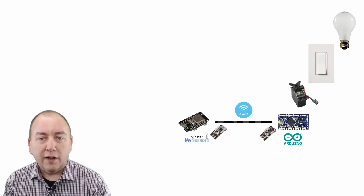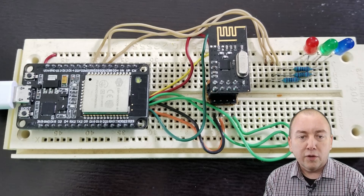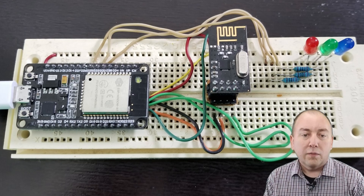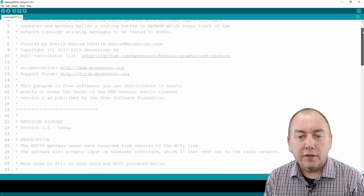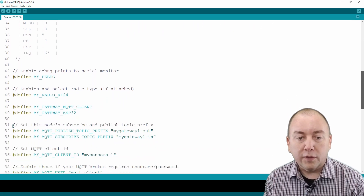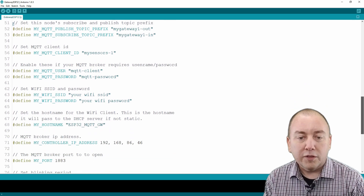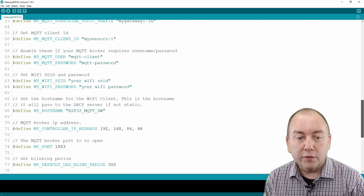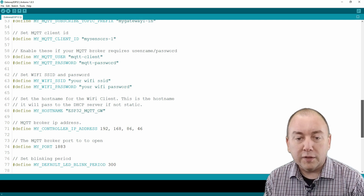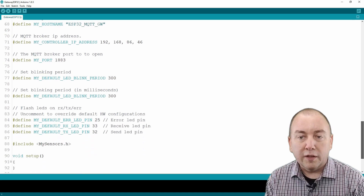Our next device in the chain between our light and the smart speaker is the MySensors gateway. I am using an ESP32 NodeMCU as the MySensors gateway. The ESP32 has built-in WiFi but needs an NRF24L01 transceiver wired to it. This allows the ESP32 to act as a gateway between WiFi and all the nodes with NRF24L01 transceivers. For this project, I used the Gateway ESP32 MQTT client sample app provided with the MySensors Arduino library. The only things I had to change before compiling and loading the code were my WiFi info and MQTT server info. This client automatically publishes data received from sensor nodes via the transceivers to the MQTT topic matching the node and sensor ID, and also subscribes to all MQTT topics with the provided prefix to transmit data back to the nodes.